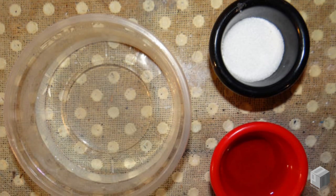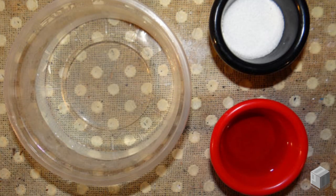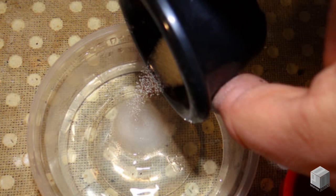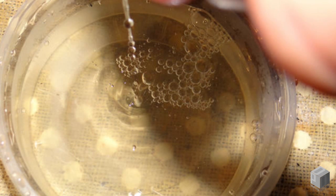To prepare the electrolyte, first stir the 4 tablespoons of table salt into the 4 ounces of distilled water until the water has reached its maximum salinity and the salt no longer dissolves. The water should have a milky white appearance. Be sure to mix thoroughly before adding vinegar. Once settled, add 1 ounce of vinegar. Mix and allow it to sit.